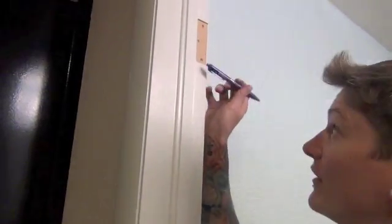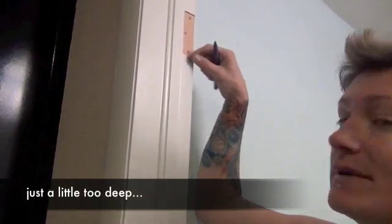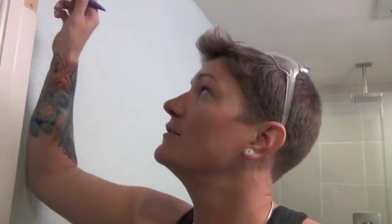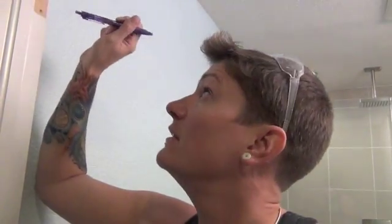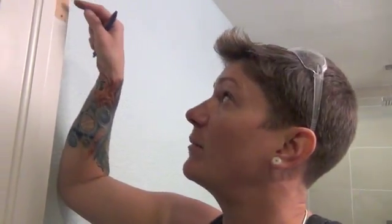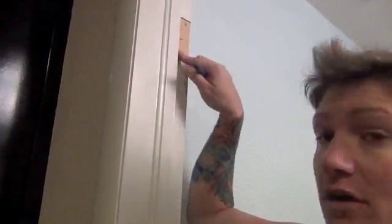Here's a lesson. Check on the hinges here how far in they're cut. This is 1 1/4 inch. So the hinge sticks out a little bit. I cut mine in 1 1/2 inch. So I'm gonna have to unscrew the screws, back it up about 1/4 inch, pre-drill my holes again. This jamb's MDF, you wouldn't really need to pre-drill MDF, but I have pine. So I'm gonna pre-drill those holes, and I'm gonna have a gap that I'll need to caulk in. However, the doorstop goes pretty close, like a 1/4 inch back. So that'll help hide my mistake.